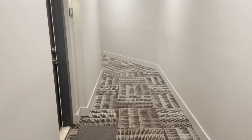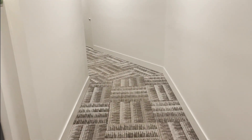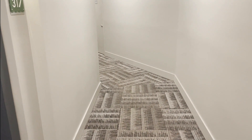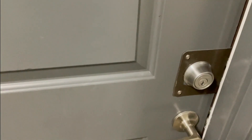It could be a faulty GFCI, or it could be that it's wired wrong. Often people wire GFCIs backwards — the line and the load. We'll find out. Come inside with me and we'll see what's going on.